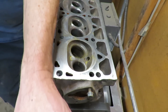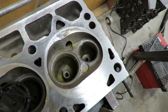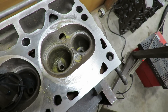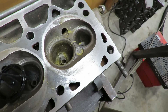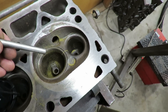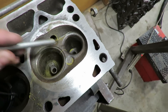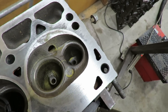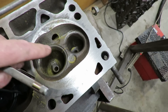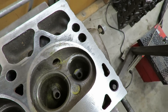I'll move the camera and get a real good shot from up above on that. You can all see that we have a crack right here and it's running right between the seats right down there. That is our — this is the cylinder that I suspected because there was some pitting here and it looked like there might be a crack there, but now we have verified it for sure.